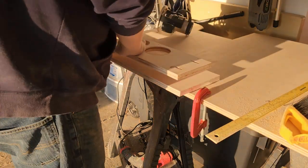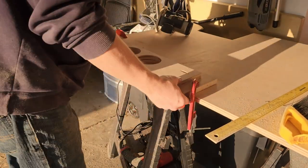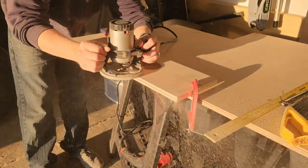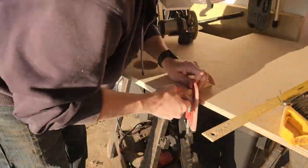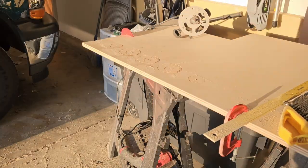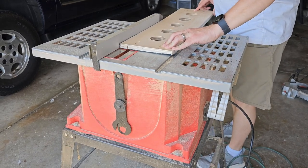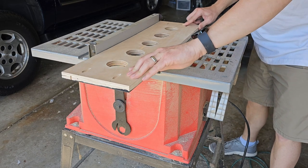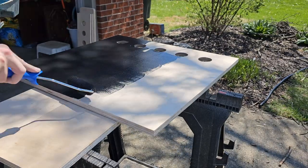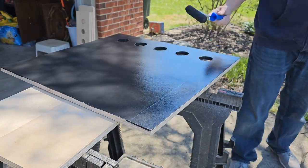I ended up cutting a new top panel for the main cabinet as the old one needed to be replaced to accommodate cooling. Mating this new panel with the bottom panel of the back box introduced me to a problem with wide body cabinets and standard size back boxes. I pressed on and finished the panel features — I set up my table saw to allow a half inch deep channel to be cut into the top panel, which is used for the glass to allow it to be inserted into the back box. I then painted all the panel parts that would be visible from the outside, except the outer side panels, as these will be used for artwork in the future.